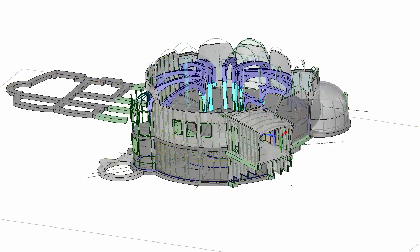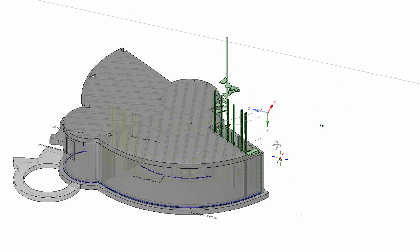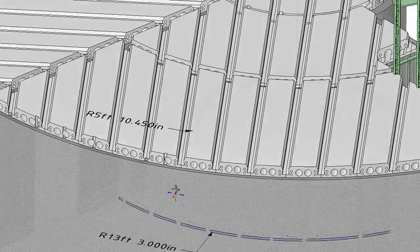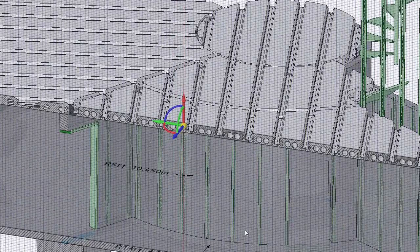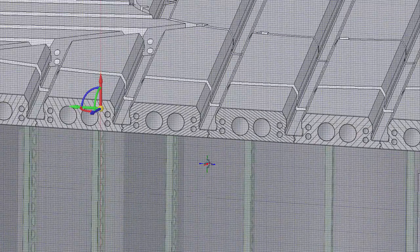Let's start with a look at the computer model. The next step in the build is to get this concrete floor over the basement. We plan to pour the concrete over this styrofoam formwork called quad deck. If we run a cut plane through the model, you can see that these styrofoam deck planks interlock to form a continuous pan floor that will hold the concrete.